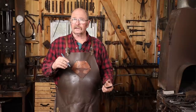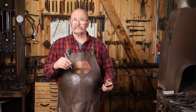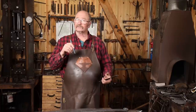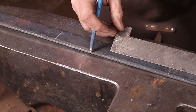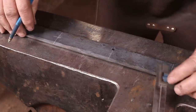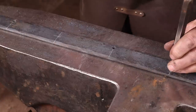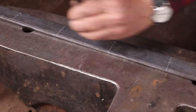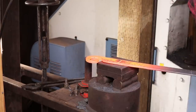Today, I think I'm going to use a teardrop punch and see what I can create with a teardrop punch flower element. And I'll use a roundhead mounting screw for the center of that flower element. The center punch marks both where the screw is going to go, and it will give me a good reference point for putting the element around the screw.